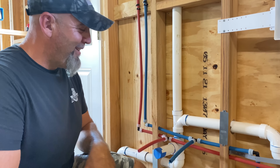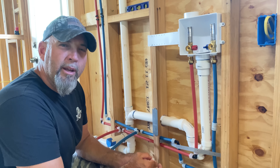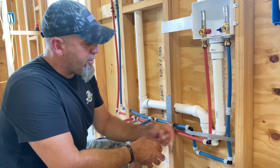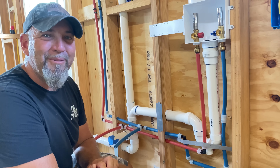I put in the tee. That's some good work right there — that's solid. Well, that was the tee that we've been waiting for — that completed that project. But look at what I did — I did a re-route right here. One of the things I noticed was whenever we were running this PEX, we were running out of real estate. Someone in the comments said we needed to be really careful about these lines rubbing together because of a chafing issue. So instead of running these lines over the top of them, I 90'd it down and made a little loop around to go up through here, so they wouldn't be rubbing on one another. I even put a little piece of plumber's tape in there to hold it back into the spray foam whenever they shoot it.